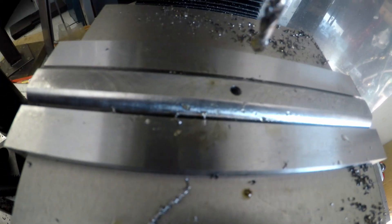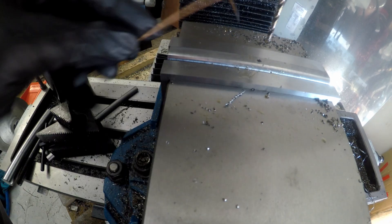Had to go sharpen the drill - this 4140 is a lot harder than mild steel. Anyway, I've got my first hole going. What I've done is bent some welding wire at a certain distance so that when it bottoms out my hole is at the correct depth and I don't bust through the bottom.